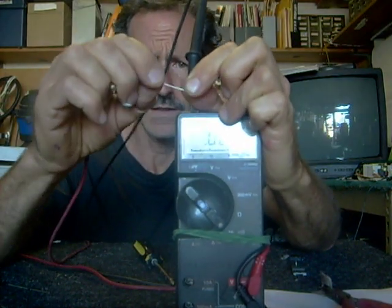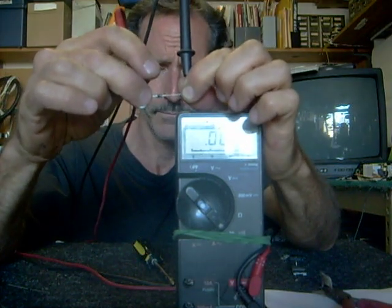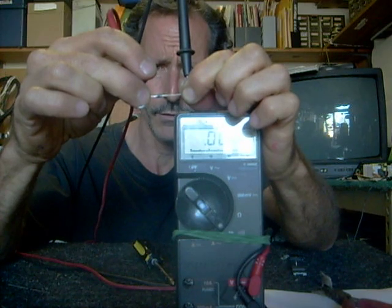This reading shows you the voltage at which the diode starts to conduct. Now, if I turn this diode back around the other way, you'll see there's no conduction whatsoever. So just remember, a diode is like a valve — it allows current to flow in one direction.